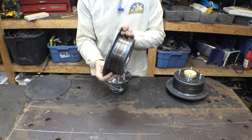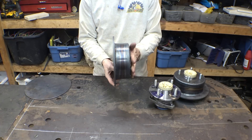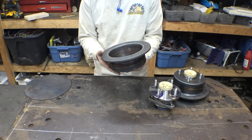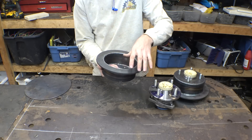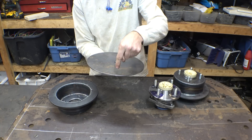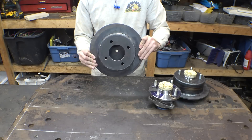I'm pretty much building these almost identical to how I built them for the VF1000 project. They seem to work great for that project, so I'm building them the same. We still need to mount this back in the lathe and machine this surface so it's perfectly parallel, so when we mount the brake disc it's not wobbling. I cut this a little too big, so we've got to take about a quarter to half an inch off. Then we can start working on the brake disc itself — mount it in the vertical mill to drill all the venting holes, then cut a giant hole in the center so we can bolt it onto here.